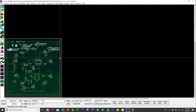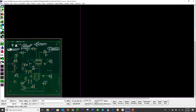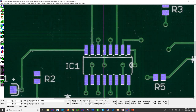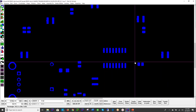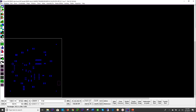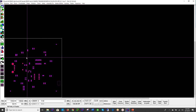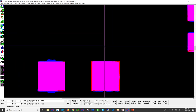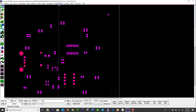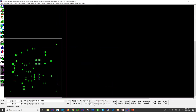Let's focus on the reverse engineering process. We scan the board and you see it in color. We then color separate on the parts of the board that are of interest — starting with the pads. The system creates those pads automatically through a process called vectorizing, which converts the bitmap image into high-quality CAD data — into flash pads. We put that on a different layer, then merge it in. CAD data appears as green. We've just created the pads for the top layer of the board.